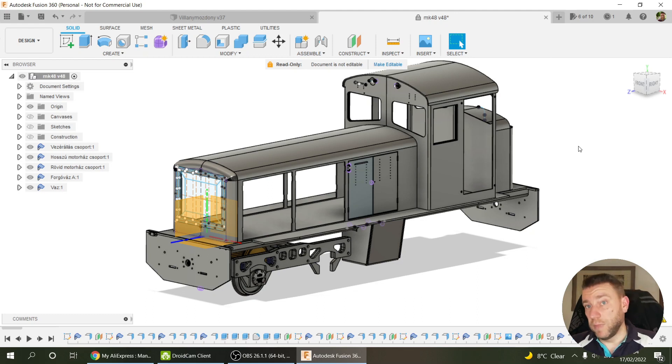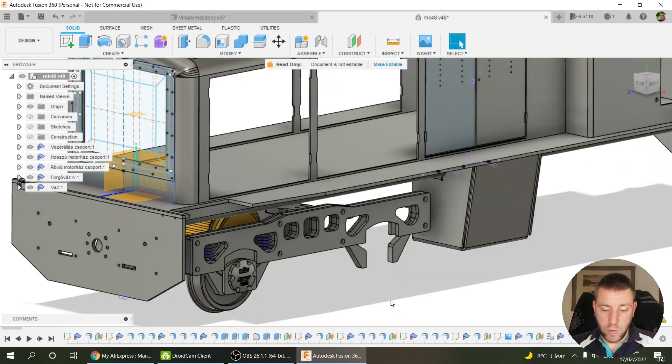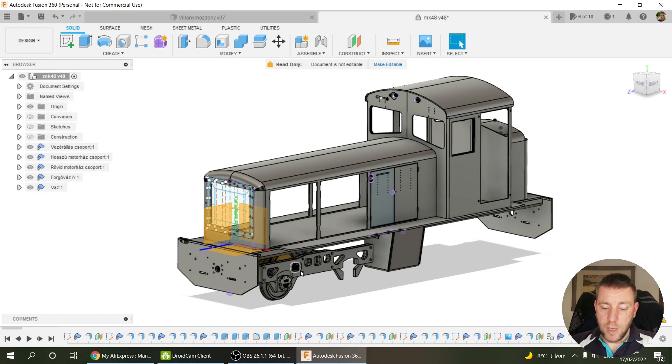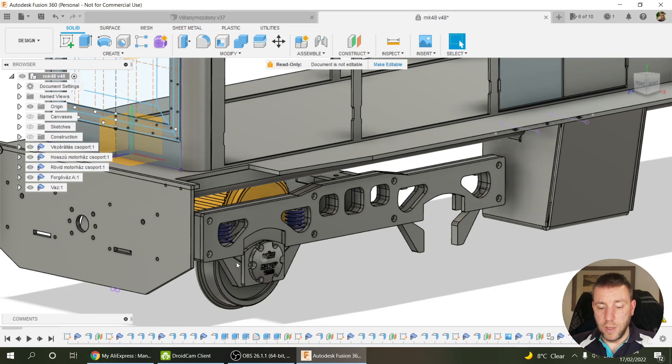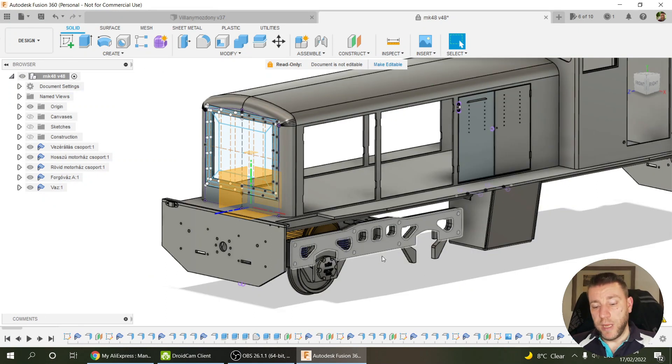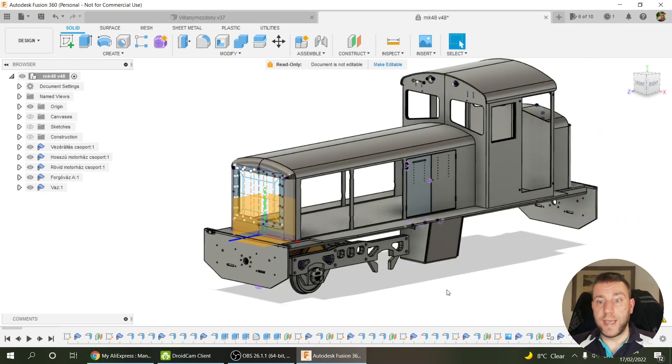So we only have around 30 of these. When I designed it I ran into all sorts of issues. First, I wanted to model the bogey to be at least very similar to the real one, but I ran into issues with how to make the bogey have some springs so the axles aren't rigid. I also had a lot of size constraints because this is a narrow gauge loco. I designed the whole thing to 1:6 scale, but in a real loco the gauge would be much smaller than 7.25 inches, so compared to the body the bogey is really oversized, and I knew the bogey was going to hit the steps.